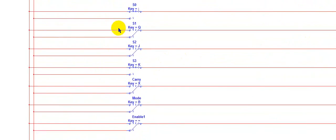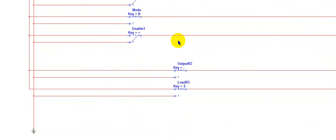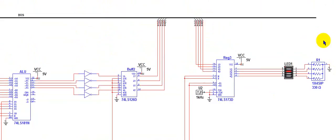Now I need to change the sequence on the ALU to switch over to logical operations. For a logical operation, I need to set the mode to high. The carry can be left low or high - that does not matter. Looking at the data sheet, I find that S3=high, S2=high, S1=high, and S0=low to do the logical AND operation. Now I'll enable the buffer, load it into the last register, disable the load, disable the buffer, and output the result. The result should be low, low, high, low. Looking at our output from the bottom: low, low, high, low. So we have the correct answer.